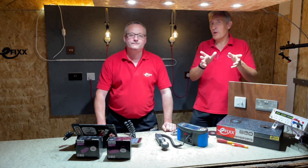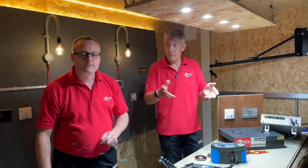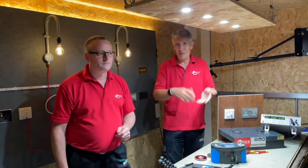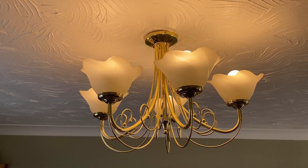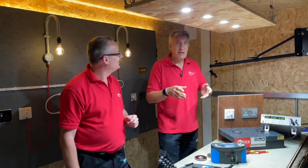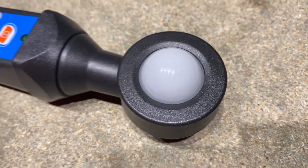How do you work out how many downlights you need to light a typical space? On social media you see rows and rows — that gridiron approach which floods the area with light. A lot of people like even illumination, which with downlights can mean you're actually over-lighting the space. Lighting is very subjective and comes down to personal preference. Older people need more light too, so it's very subjective, and trying to fit a one-size-fits-all approach gives us potential to save energy.